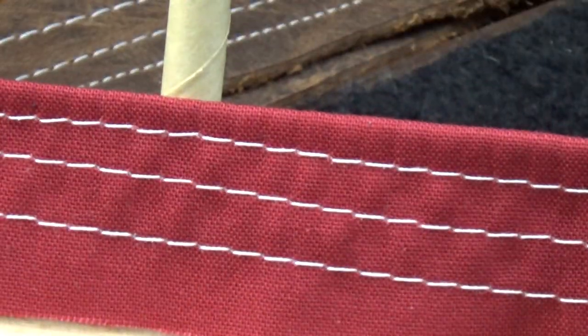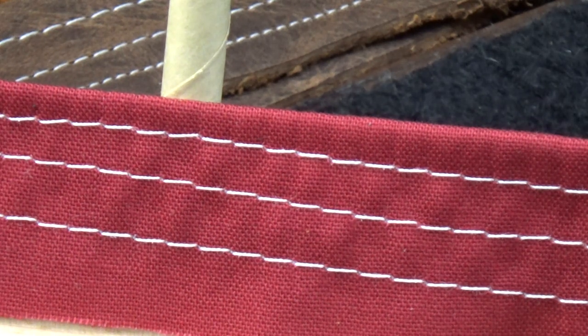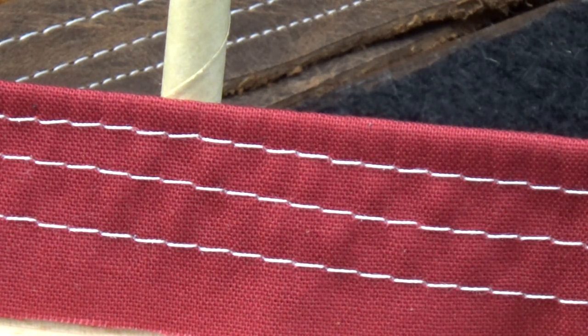So the totality of the stitching on the lock stitch, all of those stitches are certainly passable. And on page 34, because we started to lose a little bit of the alignment, because we took so much of the upper tension pole away trying to get that top stitch to be better defined, I would say that the top row is a near page 34. The other two rows, the middle one and the bottom one, are a solid page 34. But again, just realize everything is cause and effect, as they talk about in science. As you make adjustments on your tension, it's going to get you part of your result, but you might also end up compromising something else.